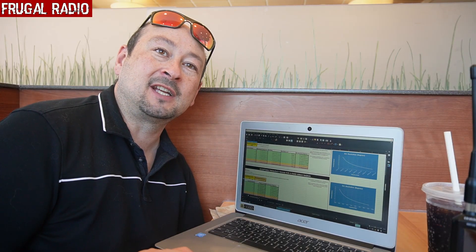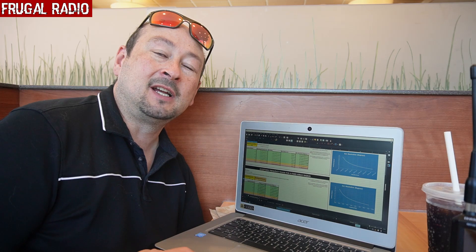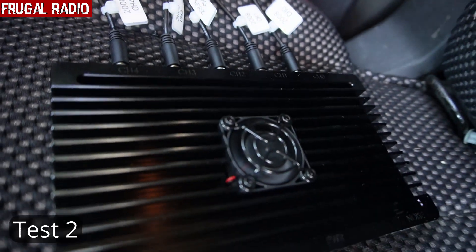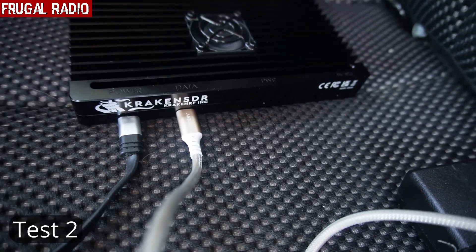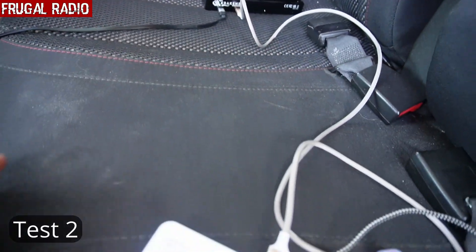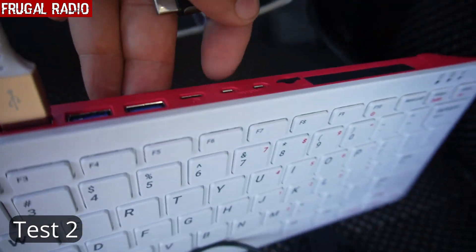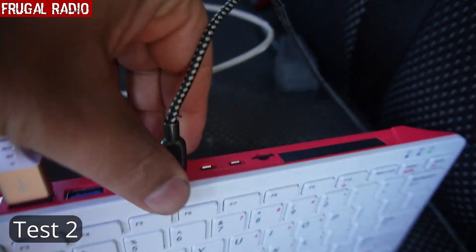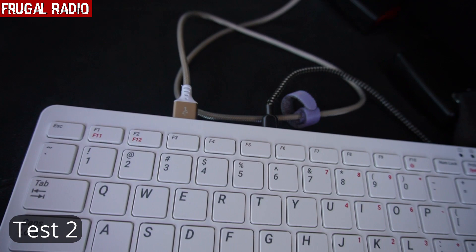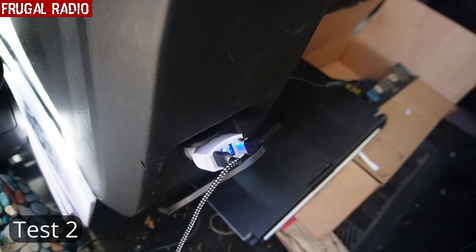It's back on the road, tracking down an emergency services P25 system site. We're heading out to direction find another site, having a great day out here with the Kraken SDR. You can see the antennas connected to the Kraken. I've just powered up the vehicle — the Kraken is powered up. The Kraken has to be powered up before the Pi; if the Pi is powered up first, it doesn't see the Kraken. The green light is flashing on the Pi, indicating that it is booting up just fine, and the Pi is connected to the SDR — both being powered off that cigarette lighter plug.